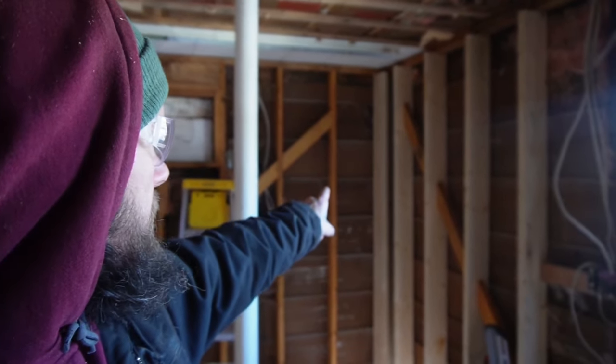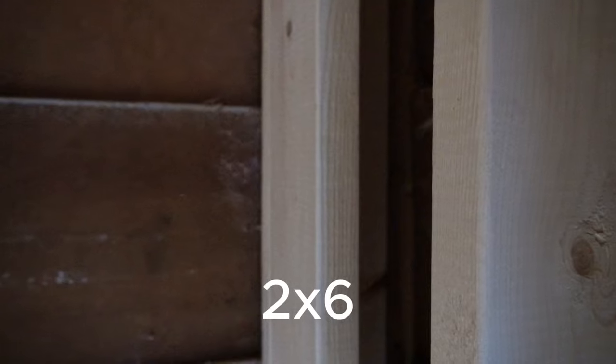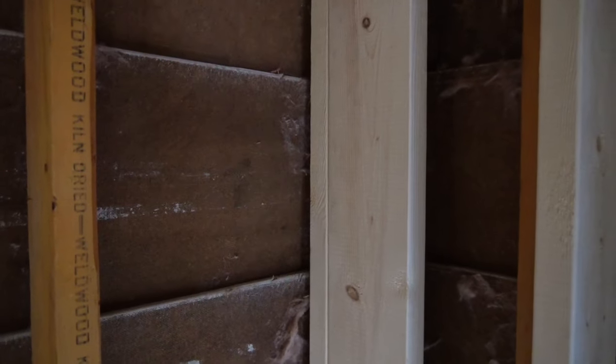Alright guys, this is as far as I'm going today. It's like 3, 3:30. It's cold. The corners are tough because they have a 2x4 spacer in between, and that creates a void — a place you can't insulate. So I did what I think they're called California Corners. Let me show you. So my other 2x4 is back there, that way the insulation can get back there, the drywallers can get in there and have a good place to screw their drywall to.